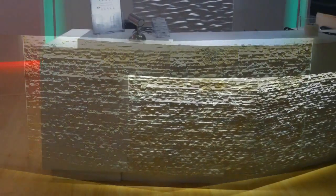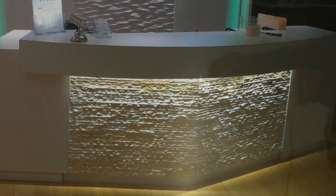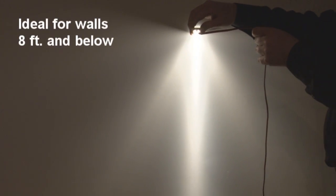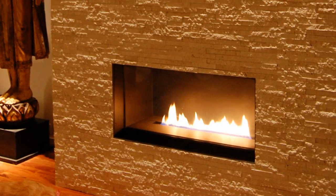Here's a great one that you can use on those lower walls — it's the Edge Lighting Micro Grazer. Now it's a 7 watt fixture, 24 volts, and it's fully dimmable with a 0 to 10 volt dimmer. It has a tight 10 degree beam spread and can be ordered between 12 up to 120 inches. It's also great for those lower walls, say a fireplace that has a nice brick or stone to it.